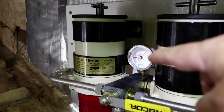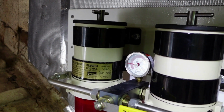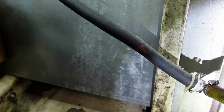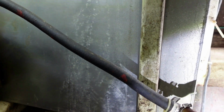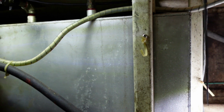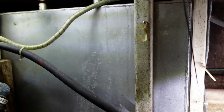It flowed for a little bit, and then resumed gaining high vacuum. So that tells you that there is something being picked up in the bottom of the tank. I then used a borescope, one of those cheap USB borescopes, to put down the deck fill to try to look into the tank, and I submerged it right into the fuel.